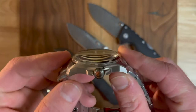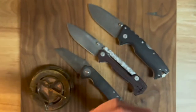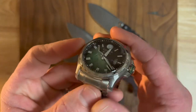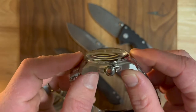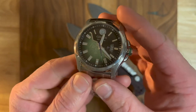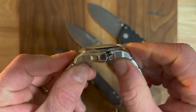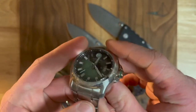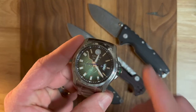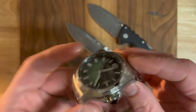With 316L there's no edge that needs to be retained — you're simply making a protective case out of steel — so that factor is removed. All you're worrying about is stainlessness and toughness. I'm assuming that aspect of 316L, combined with the fact that it has a lot of molybdenum in it, leads to really high resistance against chlorides and other caustic materials. I'm not a chemist at all — completely a DIYer — so if anyone's an expert, please comment below.